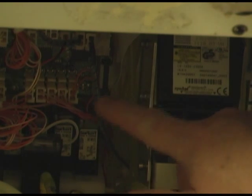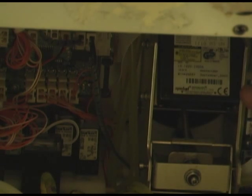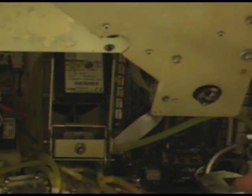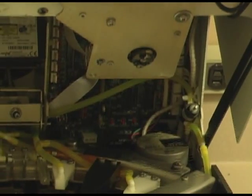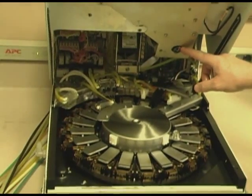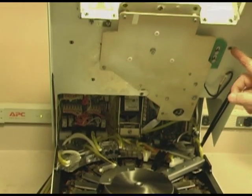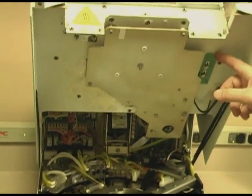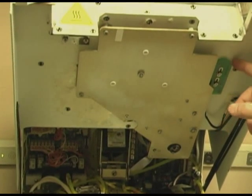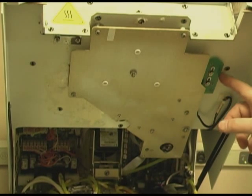You've got an I.O. board that controls all of these solenoids. You've got the barcode reader. You've got the motor back here which turns the lower carousel, and a motor up in here that turns the upper carousel. Right here is a detector that determines what reagent — it goes to a home spot and from that spot it can step through so that the proper reagent is delivered to the slide.